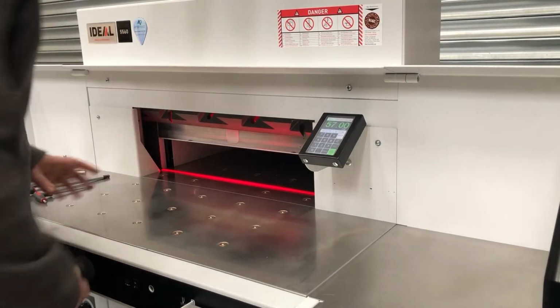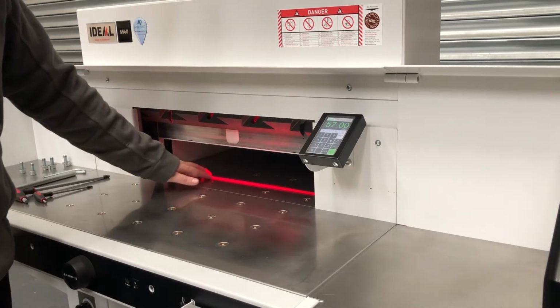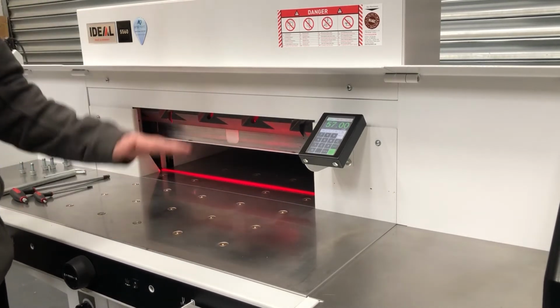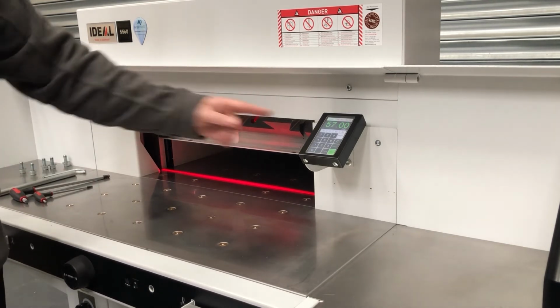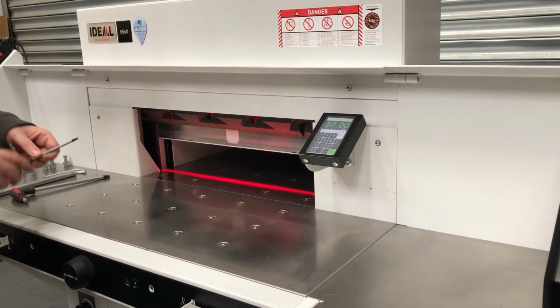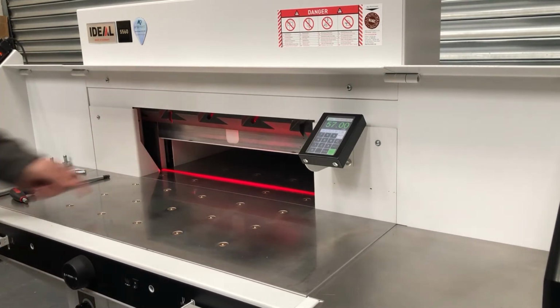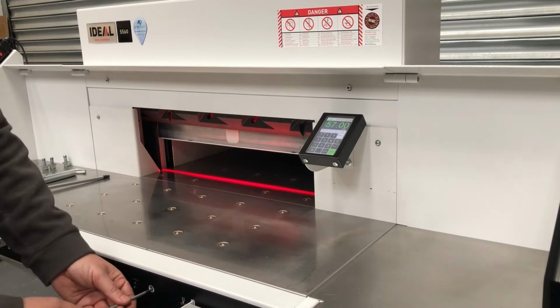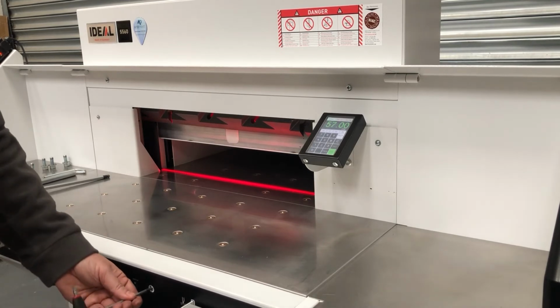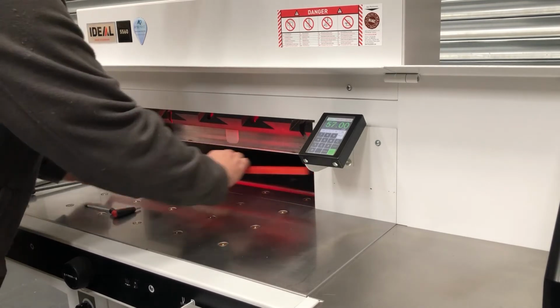Okay, so once you've got the blade out of the machine, you'll need to remove the cutting stick. Underneath there's a steel shim which spaces the cutting stick up so that you can adjust the depth of the cut, as well as the adjuster on the right hand side. So to get the cutting stick out, we've got the two screws in the front here which lock it into position. So at the moment it's locked. If we put a 4mm Allen key into here, one full rotation, maybe 1.5 full rotations is enough, just to loosen the cut stick so we can then easily lift it out.